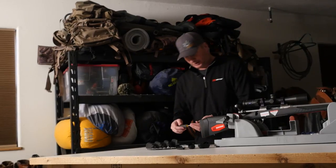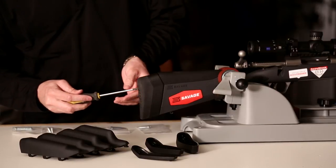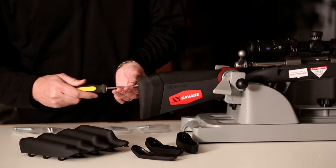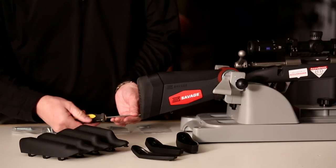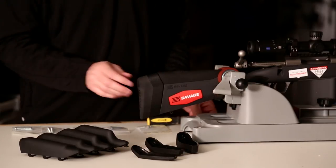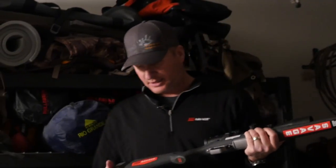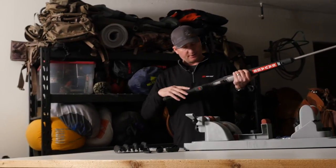The way this works is we'll just take the screws out of the back. On the recoil pad there are two holes here. We just put our screwdriver in there and take these screws out, take this apart, and change out both the comb height and the length of pull. Length of pull on the gun is basically how far your trigger is from the butt of the stock.